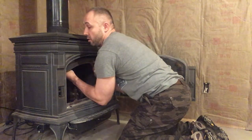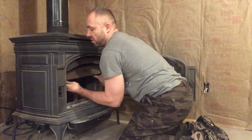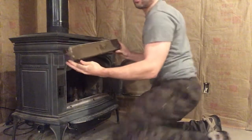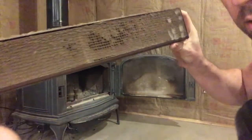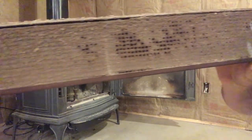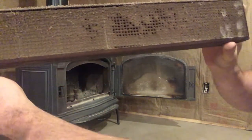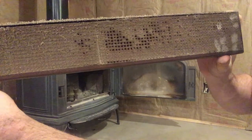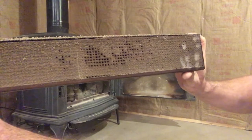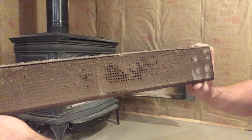This thing looks like a screen with long pores, about two inches long. You can see that's the only place air is getting through — everything else is just ashes building up. From about Halloween through November and December, that's about two months of running it. You can cause this to build up fast if you open the bottom ash pan and create a lot of turbulence with ashes.